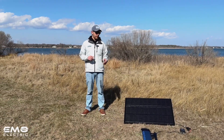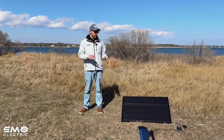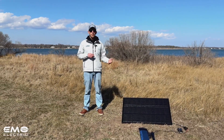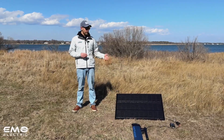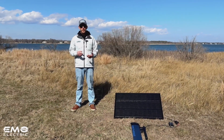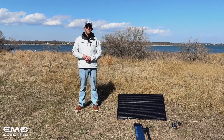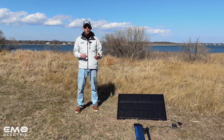Keep in mind, this is not theoretical — those are real numbers that we just got. But if you're leaving your boat on a mooring, there's no way that your solar panel is always going to be pointing at the sun. So it's worth leaving a bit of margin for error when you're thinking about the charge times.